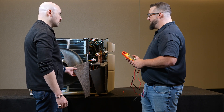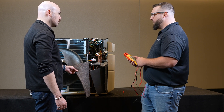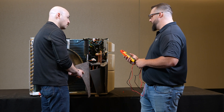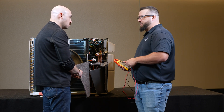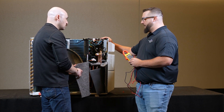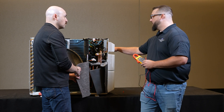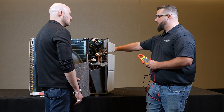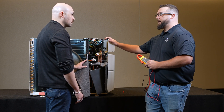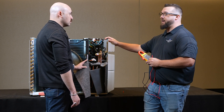One last step — in the event where you have the compressor tripping a breaker or frying circuit boards — is to test it to ground. Now this being a test unit, it's not going to be the most accurate; we don't have an earth ground set up, so it could end up with false readings. What we would do is hook one end of the meter to the ground screw tied to the earth ground of the circuit panel, then go with the other lead to each of the windings. If there is any continuity or resistance to ground, that compressor's windings has failed.